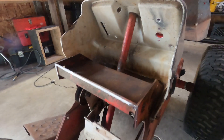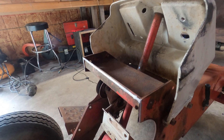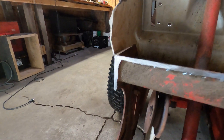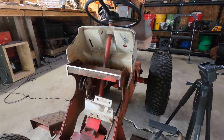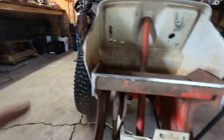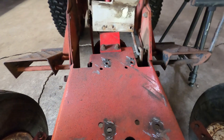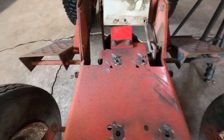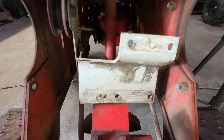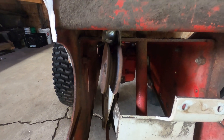I bet that is probably the tenth time that I have cut that off. And as you can see, I've gotten used to it - when I first started doing that it did not look good at all. So I'm going to grind this down so no one gets cut on it, grind it down so it looks a little better and is more flush. Then I'm going to take this plate off, cut it, and start lining up where I want to weld it underneath there.